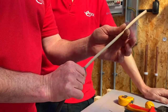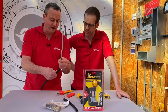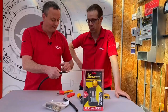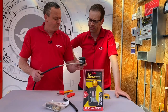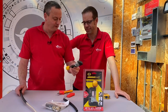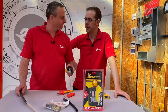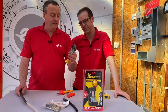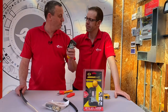With them all off — that's not bad, a reasonable effort. The issue is they're not all even on the end because it's such a short piece of armor — as we move it left and right they're sticking out a little bit. But they've broke off really neatly, they've come off quite well. The rest of the technique just requires putting an armored gland on. The question was really posed to you — could you be made right by knowing whether these are any good? I've had one attempt, made a reasonable effort first time, never used one before. I think it was user error the last time — that armored cable was very thin, maybe less than 12mm diameter. Comment below if you've used these, love these, or struggled with these. As a first out of the packet — not bad.